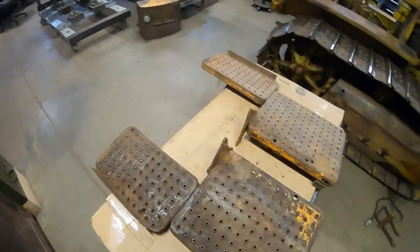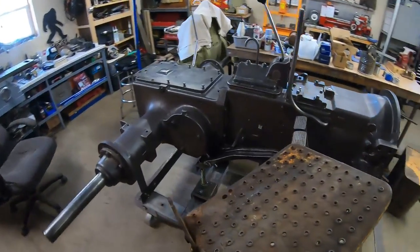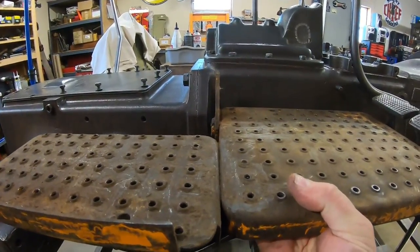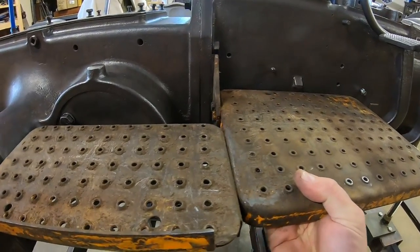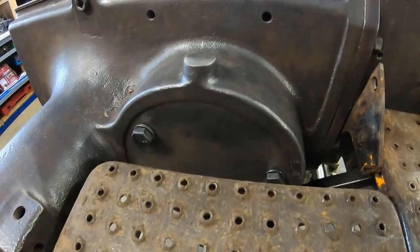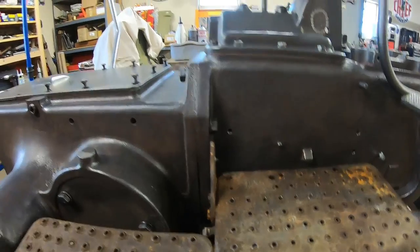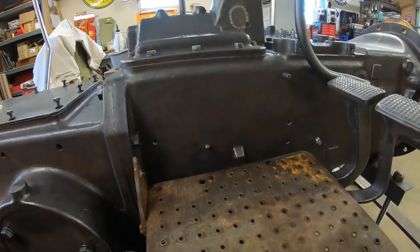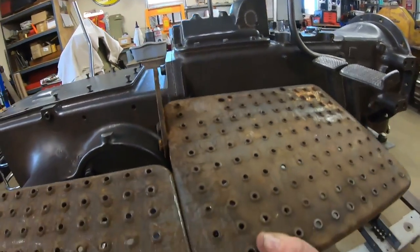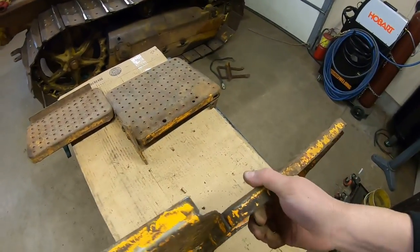And the reason they did that was the difference in how they attached to the tractor. So the prototype plates will be pretty high, okay, about this level right here. But the production plates actually attached much further down. And this back one pretty much covered over the center of that brake housing cover. So that's why they had to offset that a little bit more. And they do definitely set you up quite a bit higher on the prototype. That's also why the pedals had to be longer, because all your panels were higher and in a different spot. So that pretty much does it for the differences.